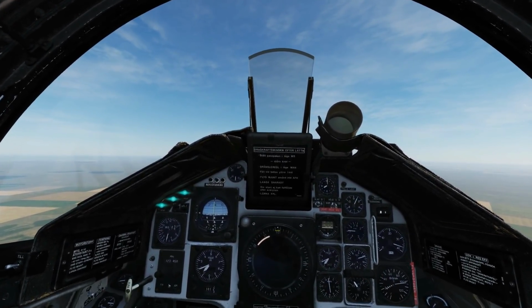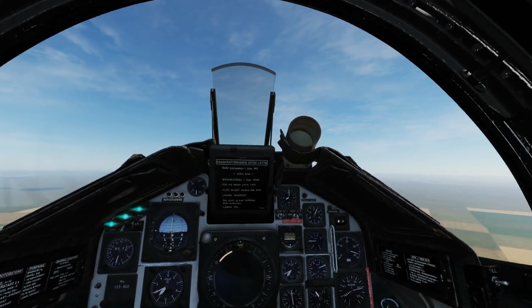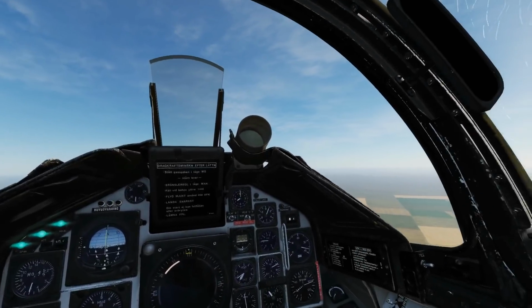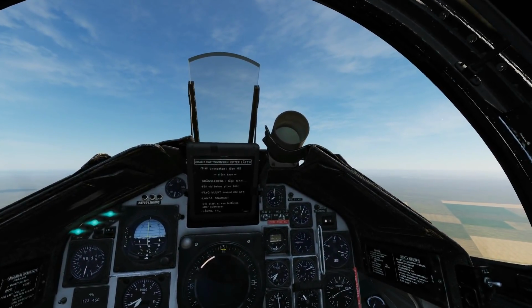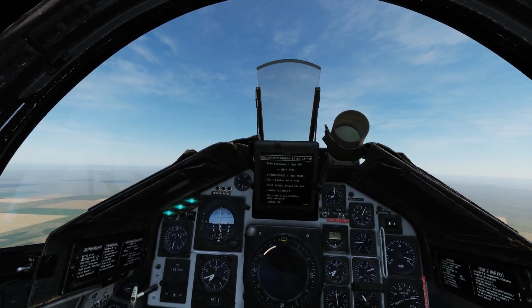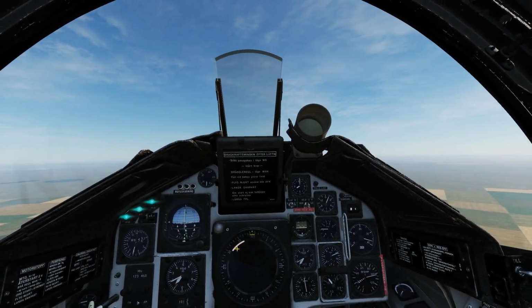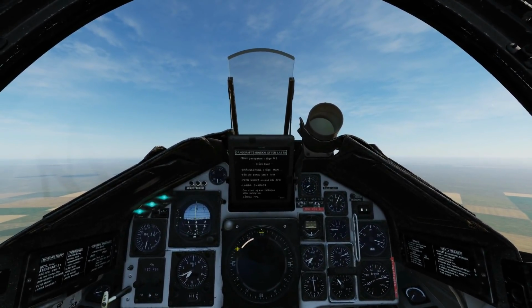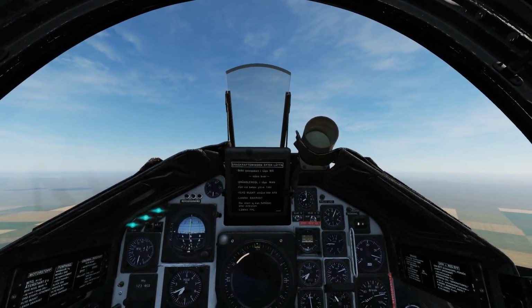search and lock. So imagine that radar out there. First of all, it searches, so it essentially scans the sky left to right, or however it does it, and every second or every 2 seconds that scanning beam will flip across our aircraft, and that's when we pick up this signal. So what I'm saying is that between the beeps, there's 1 or 2 seconds, and that's how we know that it's a search radar.